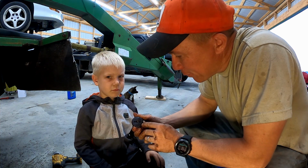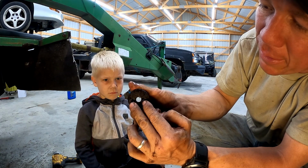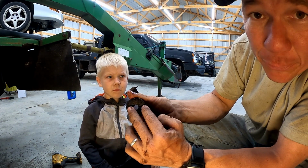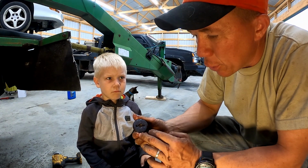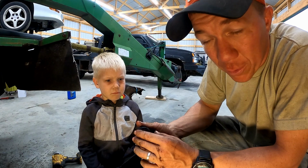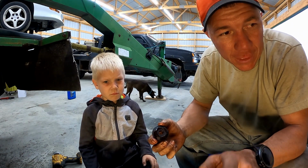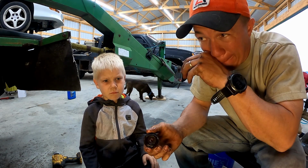We're going to have to take a pause for the cause because I'm sure you can see these two holes right here beside the main one where the bolt goes through. That's how you keep this bottom piece from spinning, and we don't have one. So we're either going to have to find one or make one in order to take these other two gears off. We've got two left, all the other ones are out that needed to come out.